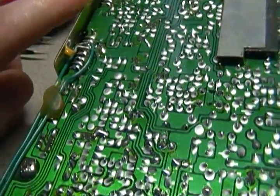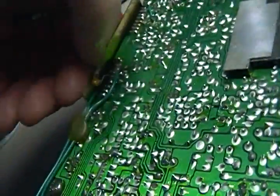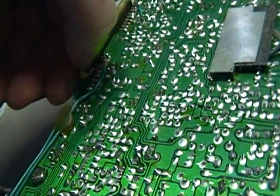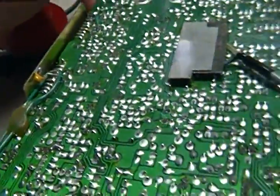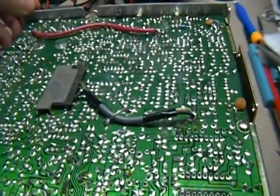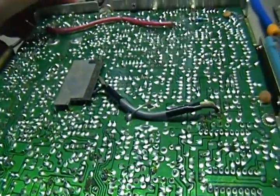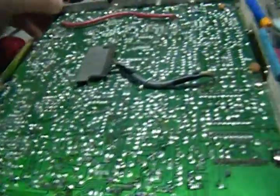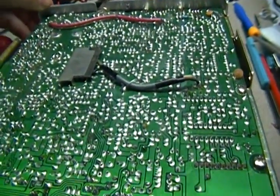I went straight to the wall because I didn't have any screws nearby to solder to, and that's fine. You can scrape off the protective anti-rust coating, scratch it up so the solder has something to grab onto, then clean it with flux — you'll be able to get it on there. It takes a little longer because it's a larger area to warm up, but it'll work. So that's your tech tip of the day for solving RF feedback and high squeals — especially if you have an amp. Bose Dagnab CB Radios — y'all have a good one, be safe, and 73s.